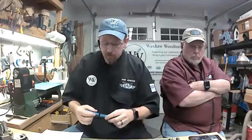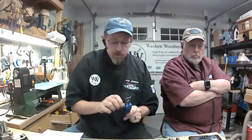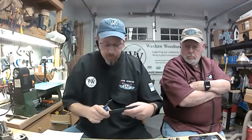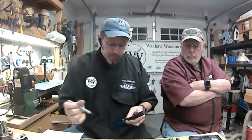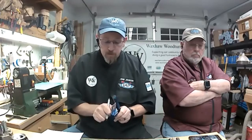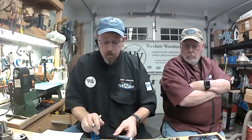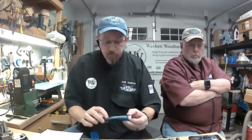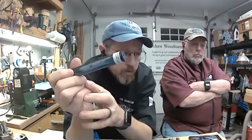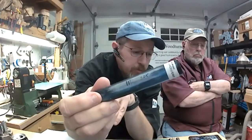So what I've done is I've taken another DiamondCast blank. And what I do, let me back up. I take 2.5 inches and mark 2.5 inches. This is going to be my cap side. And then I take 3.5 from the other end and make another mark. What I'm left with is two lines here. Let me get that in front of the camera. Two lines there, and that is going to be where I cut. That's going to be my kerf marks.